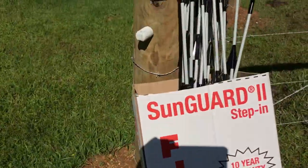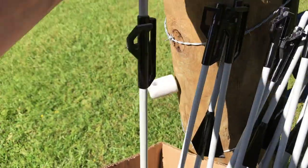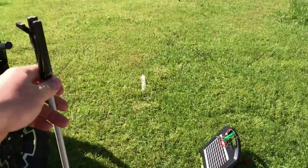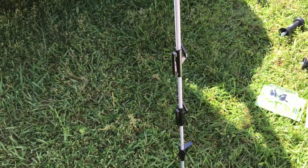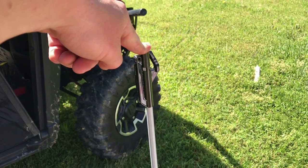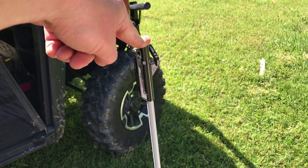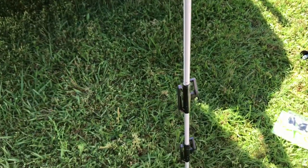Another thing that you do need is these right here. Now you don't have to have these. You can use T-post and use only T-post. You could use a different version of this. This is fiberglass versus the plastic. They're supposed to have about a 10-year warranty, but it allows you to be able to move that fence a little bit quicker than using T-post, and allows you to move the fence safely, but also has a way to hook it in to make it really fast too.